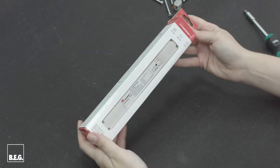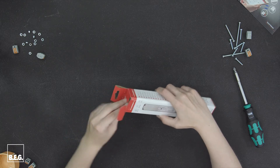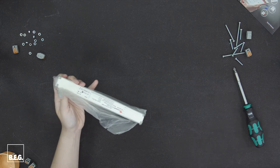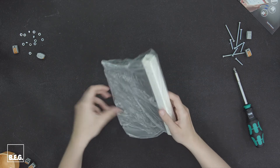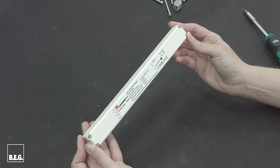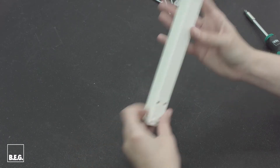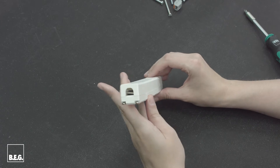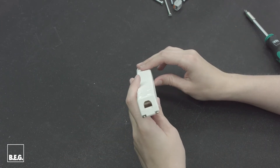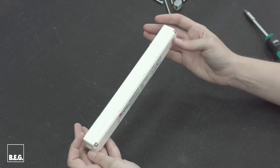The DALI power supply is used to power the sensors and the DALI ballasts or the DALI LED drivers. The DALI-Link power supply included in the starter set can supply large rooms with up to 25 luminaires. If there is a higher demand, an additional power supply can simply be connected in parallel, increasing the number of connectable electronic ballasts to up to 50. The compact power supply is usually installed in the suspended ceiling, hidden or directly in the luminaire.